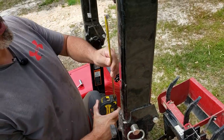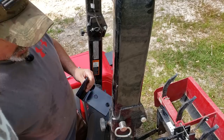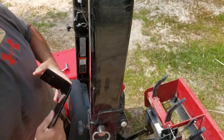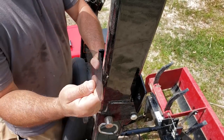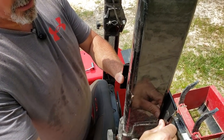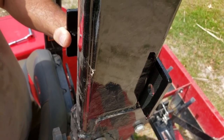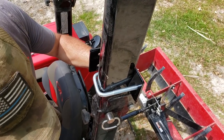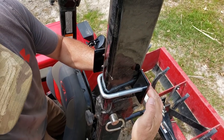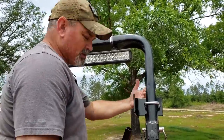The instructions say you want to measure about 12 inches down. Mine is not quite 12 inches, but I get lucky because it rests on the brackets on my ROPS. When I put my bracket here it's going to rest, and the screen will go in between the bracket and the rollover protection system — that will help as it goes under load. Put the bracket on there and loosely put your lock washer and nuts on it. These are going to be three quarter inch nuts on your U-bolts. Now that we've got the mounting bracket onto our rollover protection system, we'll do the same thing on the other side.